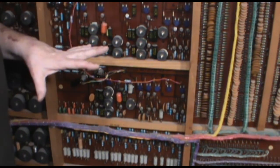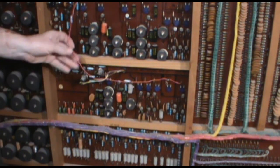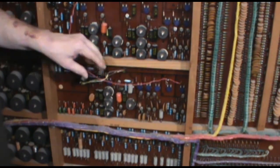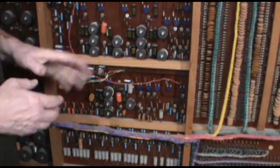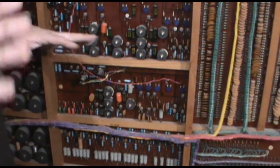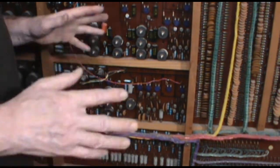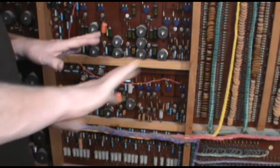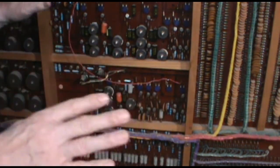In its original configuration, all three were routed to the left main channel. And I, and a lot of other people who have messed with older Rodgers instruments, thought the instrument would sound a little better if we split up the strings. At Pizza and Pipes, where I first got introduced to the theater organ, there were string ranks in both chambers, on both sides, and you could mix and match in a variety of ways with the stops on the console. So I thought it might be fun to do a little of that as well. What I wanted to do here was get the solo flute over to the right channel and put the celeste on both channels. So, how do we do that?